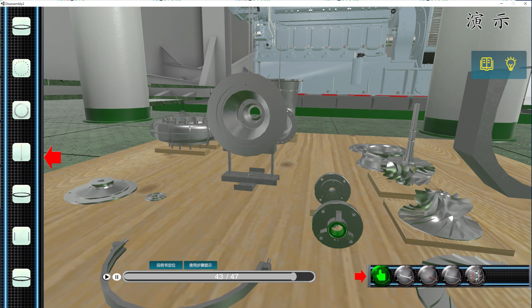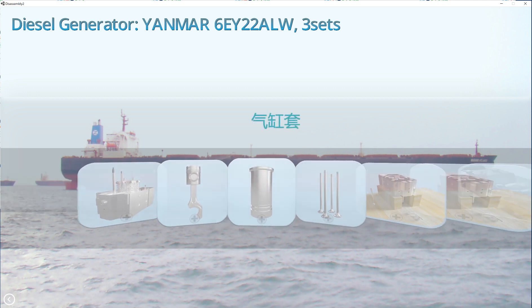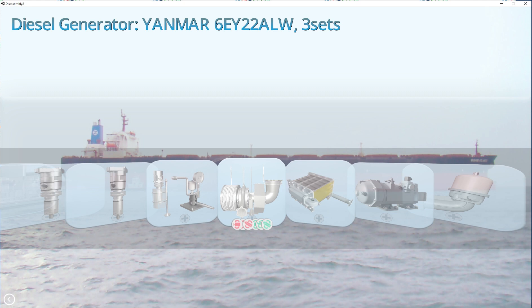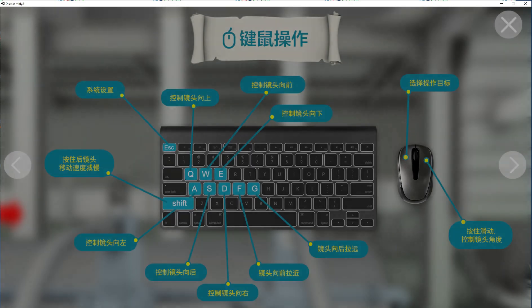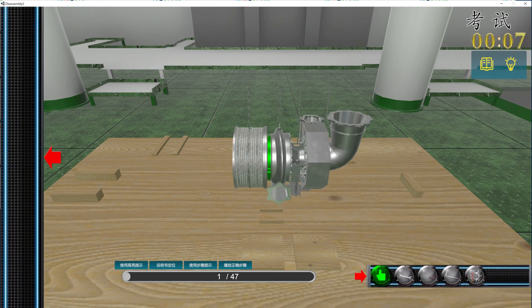This is the main body here which remains. These are the plain bearings, the thrust bearings — the thrust bearings are also visible here. It needs time; it needs proper calibration. Also it's a job where you need good support from the crew. If you are the only one who knows how to overhaul the turbocharger, that really doesn't help — everybody must give a hand for such jobs. But if you see that your crew is not going to help you, you will not make this kind of job unless there's an emergency.